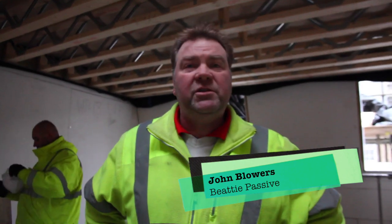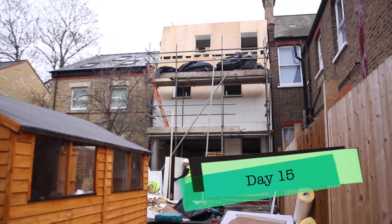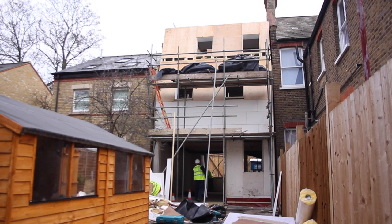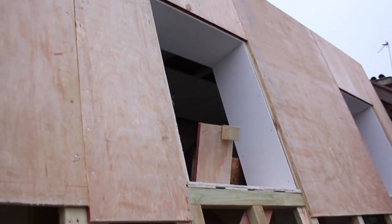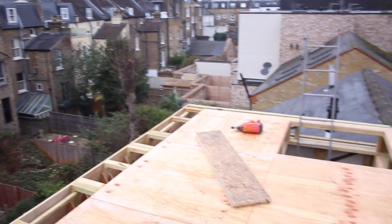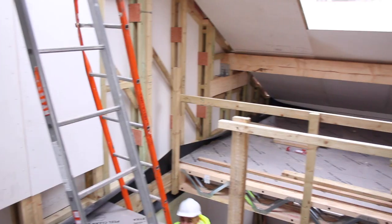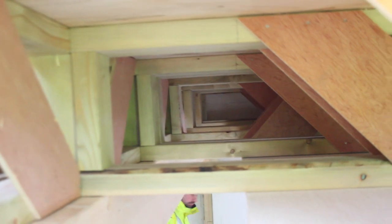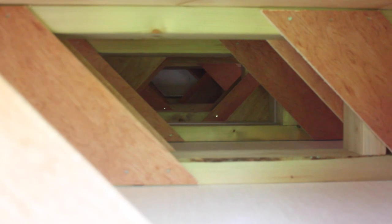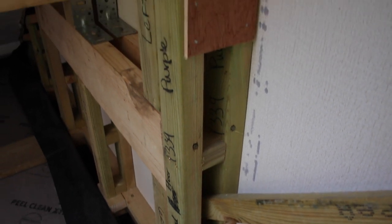We've got the rest of the gable ends up into the roof area, all the roof panels are on and fixed, we've got purlins in and glulam beams in, all fixed into position. We're now starting to get the final boarding done, and all being well come Monday we shall be eco-beading — so we'll start getting the insulation in. At the moment we've got the floor up downstairs where we're putting in air ducts, electric ducts and water, so we can get the floors fitted permanently ready for the eco-bead on Monday.